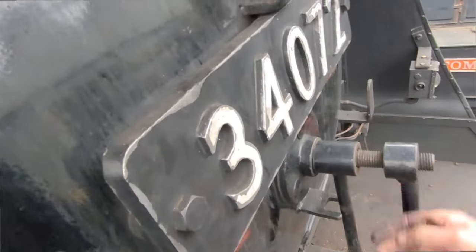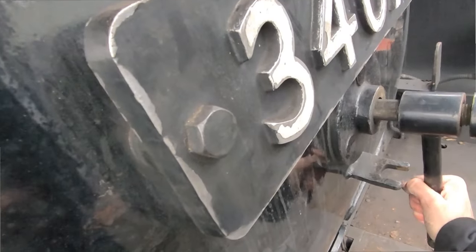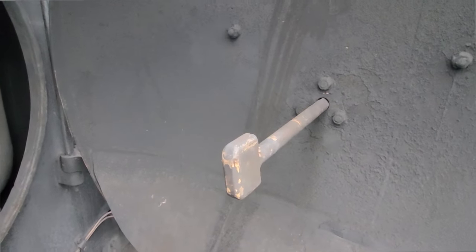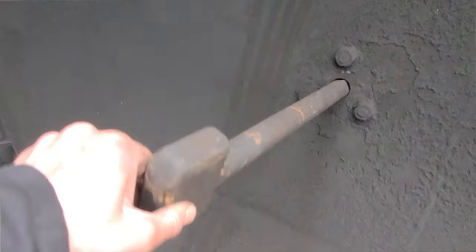We wind that off quite a lot. Sometimes you can see the locking tabs lift out a little bit, then rotate 90 degrees. Then we can open the door. If we slow this down you can see the dart coming out of the crossbar. This end of the dart has some curved corners; on the left-hand side you see it's rounded, on the right it's square. If we take a look at where the dart goes through the door, you'll be able to see the square machined part that the opening mechanism goes onto.